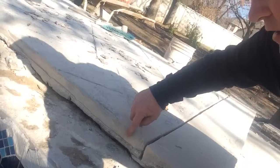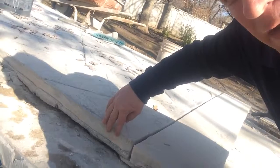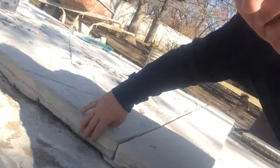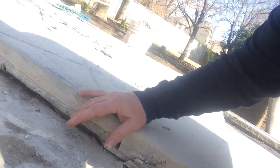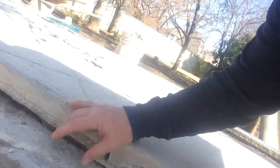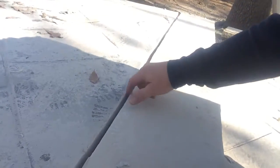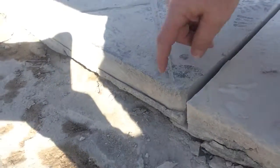You can see here, they put only just a little bit of separation foam between the new deck and the coping. Underneath the foam, the cement creeped out, causing the pressure on the coping to split. So what we're doing is we're coming in and we're widening the gap, and we're cutting all the way down, which is what should have been done in the first place.